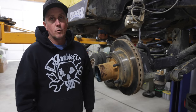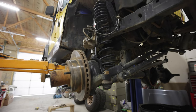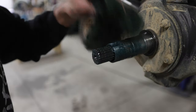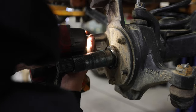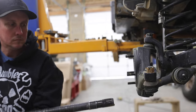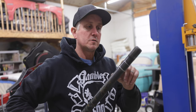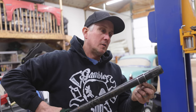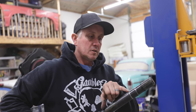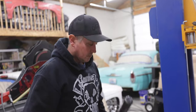After I got back from Ultimate Adventure, I've got a huge oil leak coming from where the tube is pressed into the center chunk. So right now it's time to pull the axle shafts out, pull those seals out, and I'm going to show you how to weld up that tube to the center chunk. On the passenger side, I'm checking if the inner axle seal is riding where it's supposed to - right on that little bump-up surface. This side wasn't really the problem, so we'll check the driver's side.